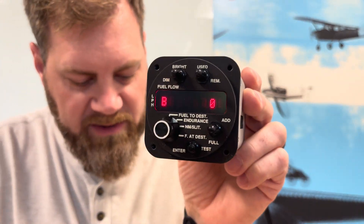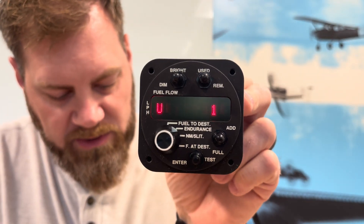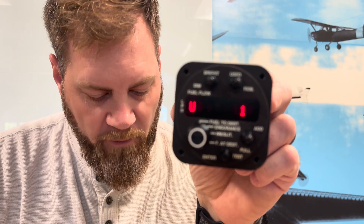Using Use Remaining again, we see 'A' is zero. This is a frequency offset for analog models — it's not used in this version of Microflow, so A should always be set to zero. The next one, 'B', is for a right engine offset — again not used in this model, so it should also be zero. The next value is 'U', which is how the units are determined. This is set at the factory and shouldn't be adjusted in the field. If U is zero it's gallons, if it's one it's liters.